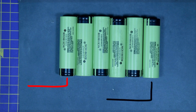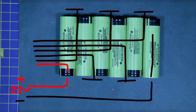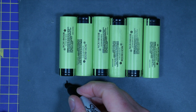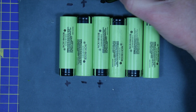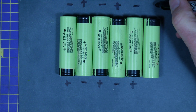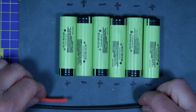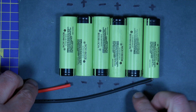This is how I'll be wiring it up. The positive and negative go out to the XT60, and these are the links and the balance leads to the JST connector. We've got alternating positive and negative terminals across all six cells, and I'm going to solder this wired XT60 across the first and the last negative and positive terminals to get a nominal 22 volts.